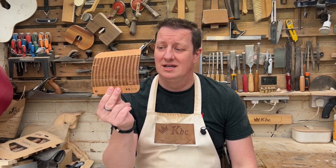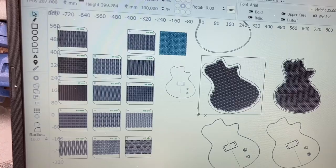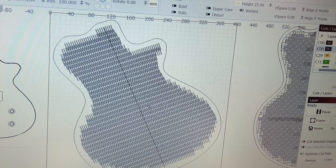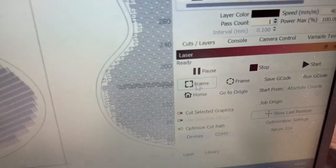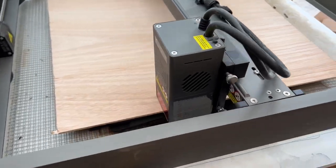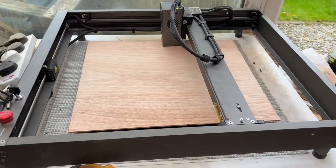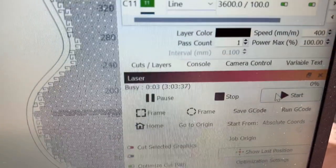So can you make a guitar body out of this flexible plywood stuff? This is the LightBurn software I use to control the laser — these are all the different flexi wood patterns. I've chosen two of them and I've got a border all the way around that isn't going to get cut. I think that might be my downfall but I do want to check how much this stuff flexes in the middle with a solid edging. I'm using the Creality Falcon 2 for this, so always click frame before you set it going — that way you know the laser head is actually going to fit on that piece as it goes through, the wood's in the right place. You don't want to get halfway through a cut and realize the laser is going off the edge. Once you're happy, click go — and apparently that's going to take three hours.